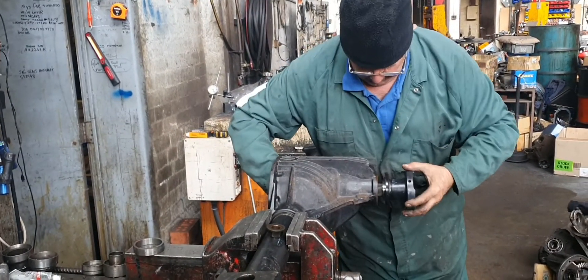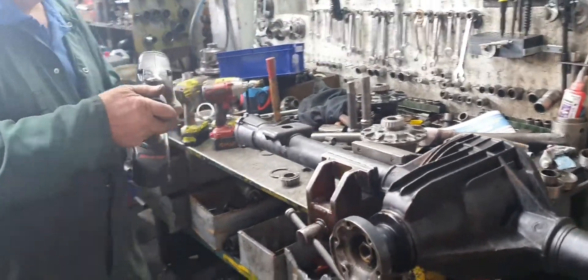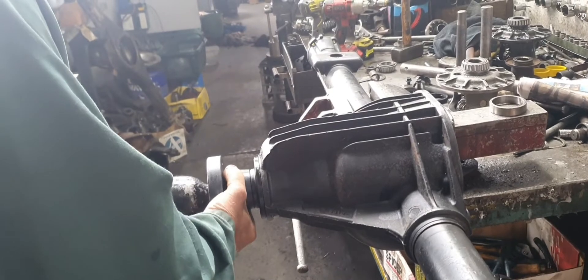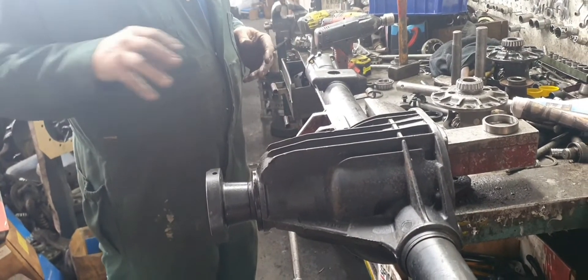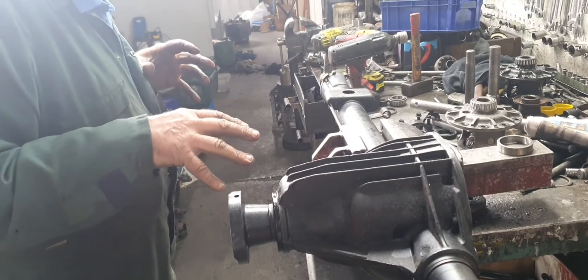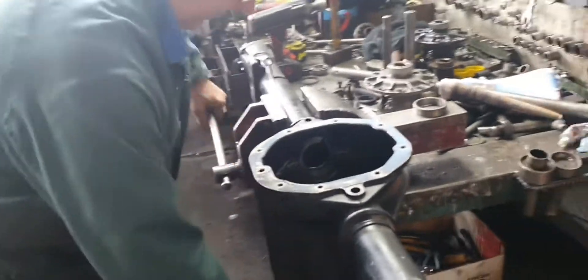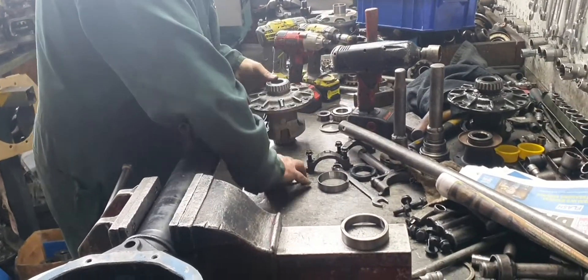I like to make sure it slips halfway on. Someone fixing a diff from America — you're watching, were ya? You really gotta leave comments on these people saying how ridiculous the shit they do is. In America the bloke will put the collapsible spacer on there — he's pre-loaded it all up, then put the carrier in, then said I've got to take it all apart now. I'd like to use another collapsible spacer because you can only use these once. You should leave a comment saying you can stretch them — what did the old man stretch them on, an anvil, 50 years ago?